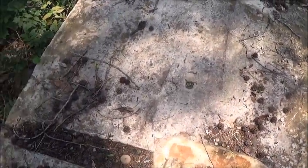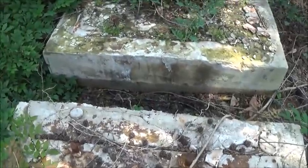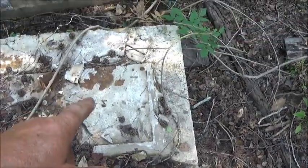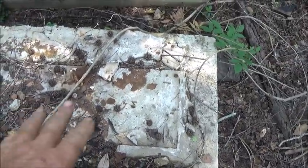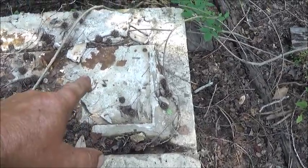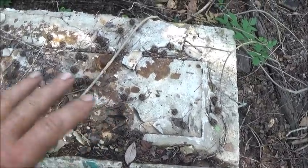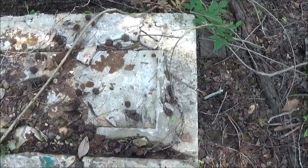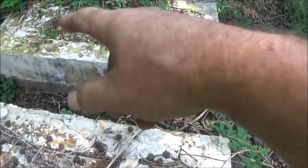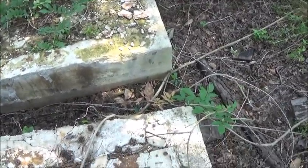So this will give us a chance to check a few things that I missed. Here's our step-down we're working on, and it looks like they grouted the entire thing and brought the whole thing above the deck. So maybe that's what we need to do — just grout the entire top and then set it down. I think I went five foot six wide with my foundation; I don't know if this one's the same width or not.